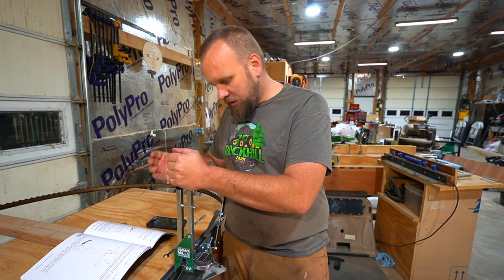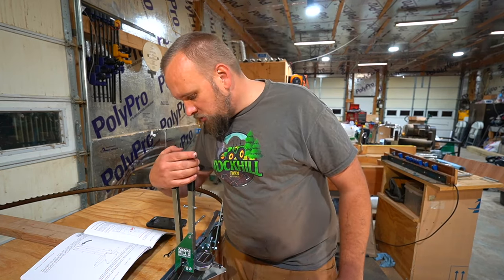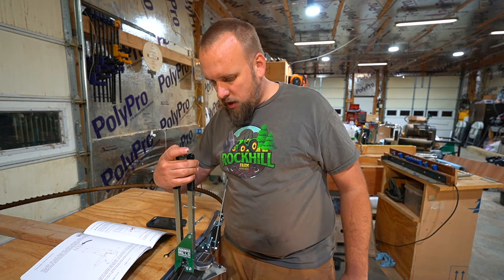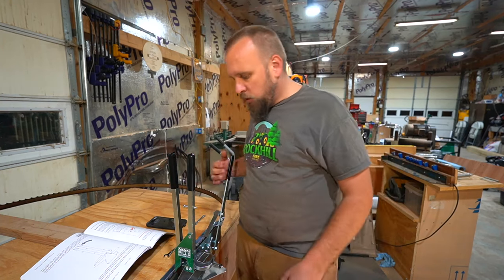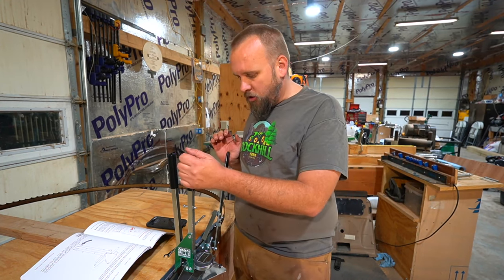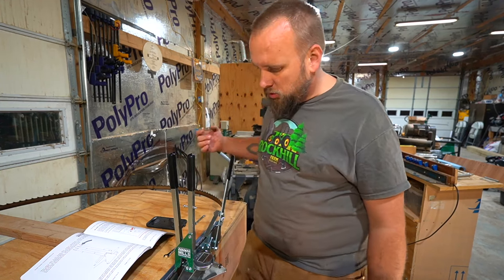So now I squeeze this hard. I'm at 1.25 millimeters. Then I squeeze it down just until the blade's flat, and my tooth right here has a 0.54 offset, and they are recommending 0.55. So now I'll pull this all the way back and then all the way forward. And it goes one tooth, two, and three. Stops it lined up with that third tooth.